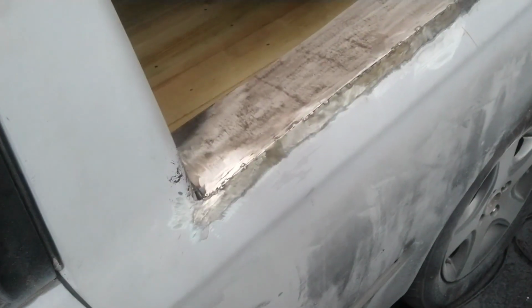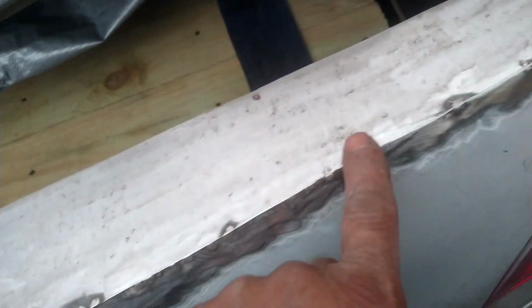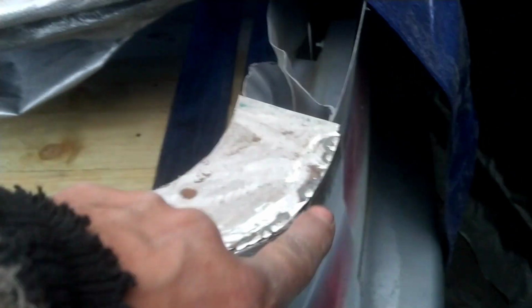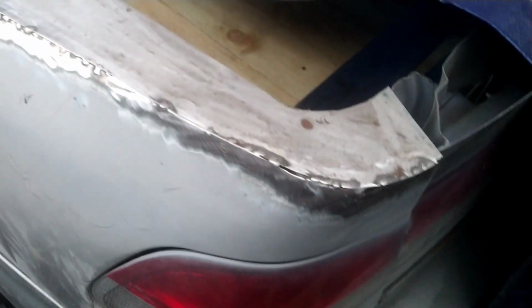Let's get it. All right, boys, so it's finally all welded. I just gotta weld through the back tomorrow, but all these edges are welded, spot welded. I ground it down, joined it together here, welded over here all the way around. Custom made that plate round shape. Remember, it doesn't come like that, so we give it that pickup look. So yeah, I'm gonna see if I have some bondo fiberglass filler, so we could fill up these gaps at least, so we could start having the body work prep somewhat. And we'll let it dry and we'll come back tomorrow and see what it looks like.